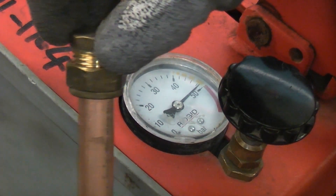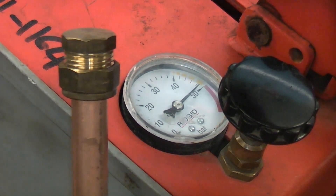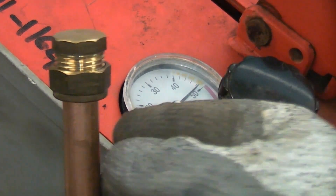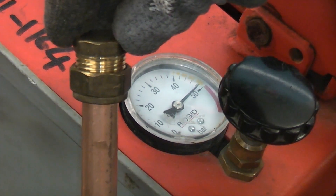So there's absolutely no need at all to use any kind of sealant, PTFE paste, PTFE tape, or anything on a compression fitting. The actual olive that is supplied with the fitting is perfectly suitable to seal the joint.